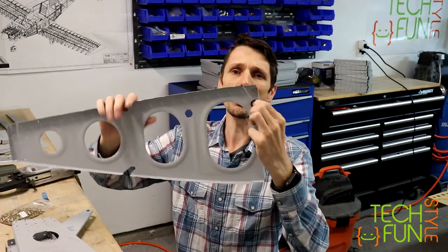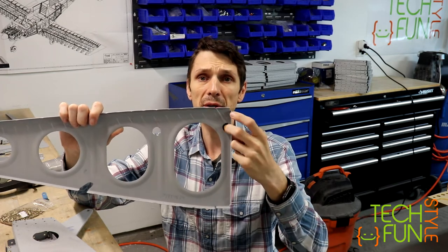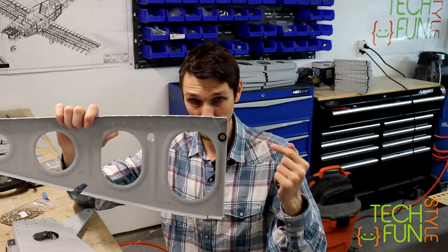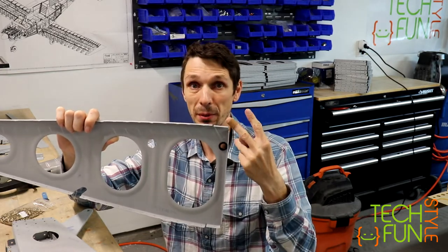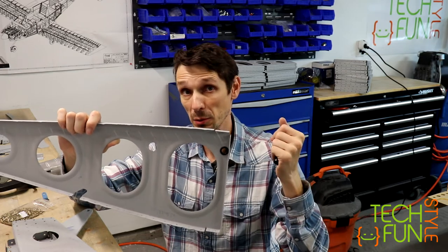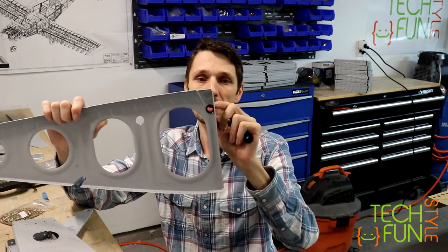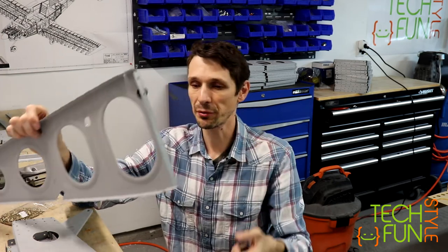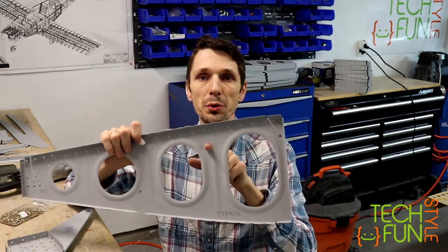And here it's quite simple. This hole, which I enlarged first, was for the pitot piping, for the pitot plumbing. I decided to make it a little bit bigger because I'm planning to also install the angle of attack. So I will need two separate hoses, two separate pipes. One will be for the airspeed, another will be at 60 degrees to it for the angle of attack. So I just enlarged it a little bit and installed a bigger insert here, so two hoses should pass perfectly.